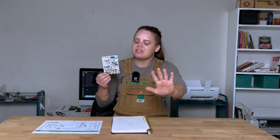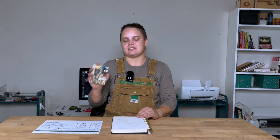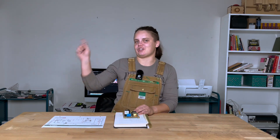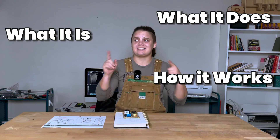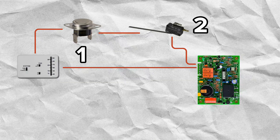Step two, this circuit board knows that you want your furnace to turn on, but it's going to say, whoa, hold your horses. We're going to do just a quick safety check before we turn things on, because there's fire, there's propane involved. We want to make sure that we are all safe before we get going. So what it checks is to make sure that your sail switch isn't stuck closed before it lets anything happen. Just know that your sail switch is one of two main safeties that are built straight into the furnace, and we'll talk about the other one later.